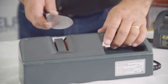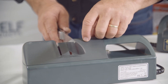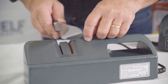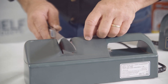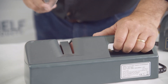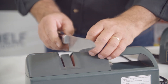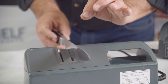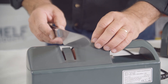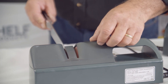Let me show you the difference between the pressures. Blunt knife up against the central guide — pressing, you can hear the motor working. What I'm doing is I'm re-profiling this knife. Left and right, four or five times. And then just to finish the knife, if the knife has got an edge on it, I'm just holding just the weight of the heads of the knife through, making sure that the edge of the knife is parallel with the bench.